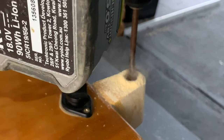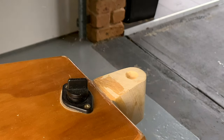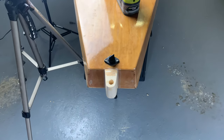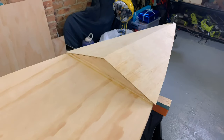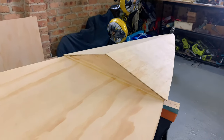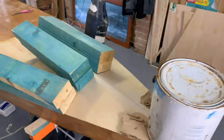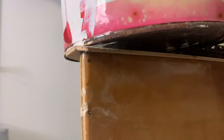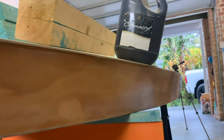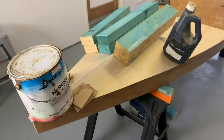I want to seal that timber before I drill another hole. Before I glue any tricky parts with epoxy, I like to do a test fit of the panels and also test how I'm going to use my weights to hold all the edges down. Looking under there — really close fit all the way through. I think we're ready to mix up the epoxy now.